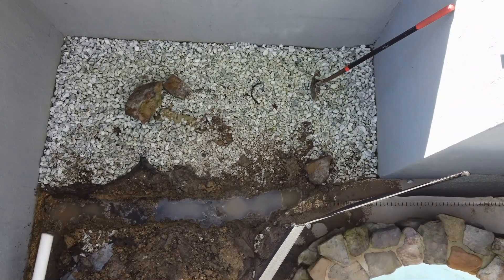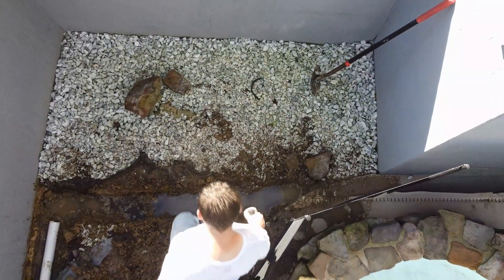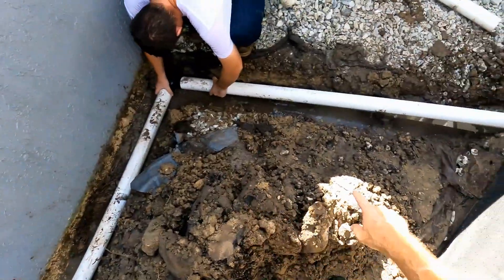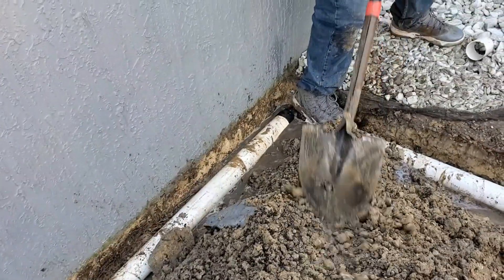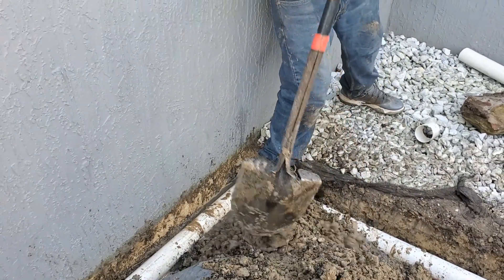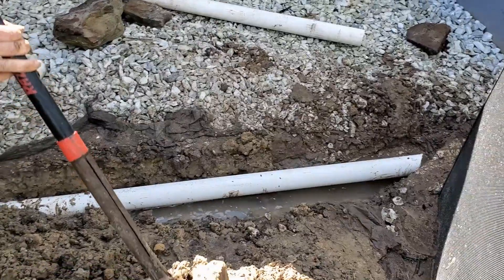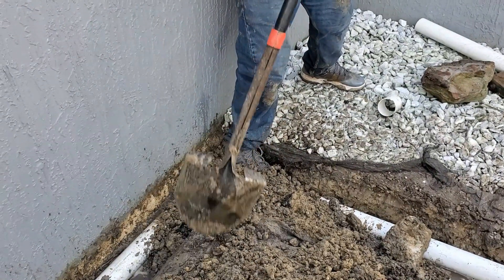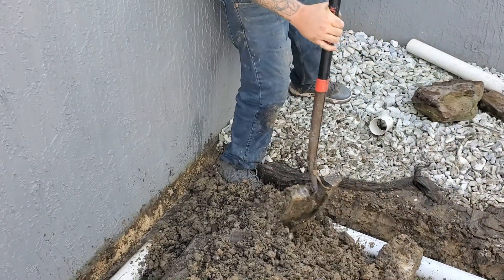Start by laying out some plastic so you can keep that top gravel clean. Next, go ahead and excavate — set your dirt directly on the plastic. Once you have this installed you're ready to backfill. Let's finish putting this together — we'll put a 90 on that corner and cut it to length. Always stand on your pipe when backfilling so you can make sure it doesn't pop up out of the trench, especially when you've got water underneath. Remember we just opened up the channel drain so all that water went down the new trench and is underneath our pipe. This is solid pipe but we don't want it to float up, so it takes a lot of soil to hold it down.